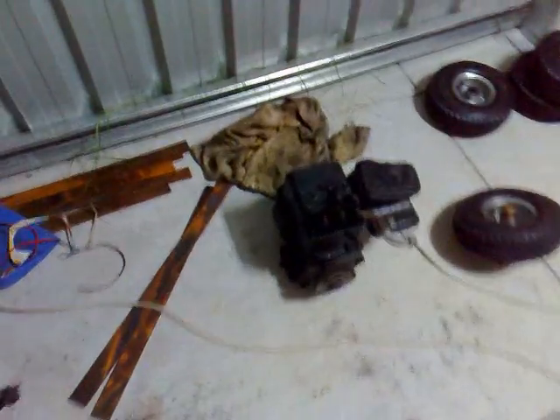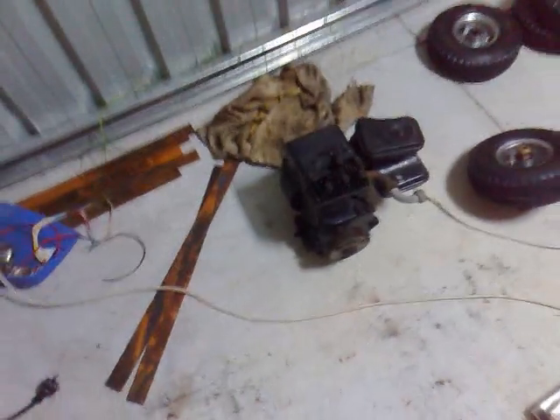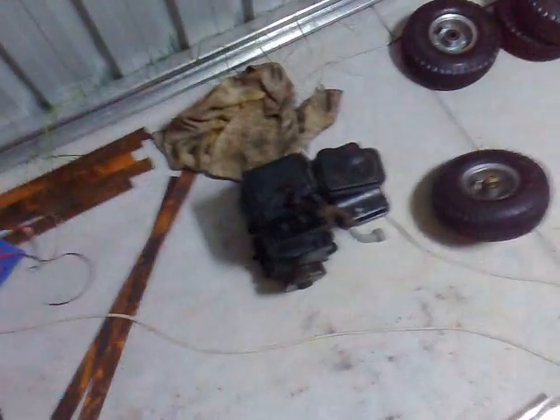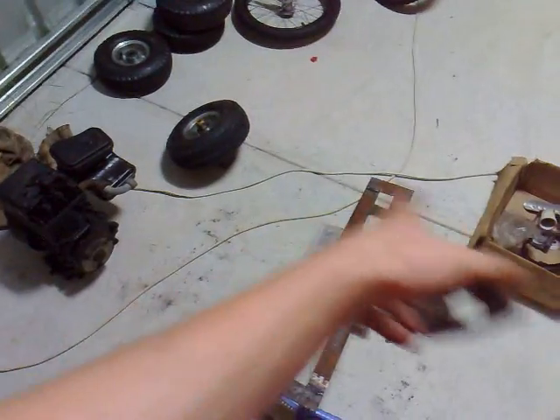I think I've done a lot. I had to rebuild that — I had to put a new condenser in there because when it was out in the rain the condenser got stuffed up. This is the old one; you can't really see much on camera but it is buggered. So I replaced it because I had a spare one. Now it runs real nice — I won't start it up because it's too late.